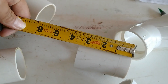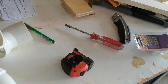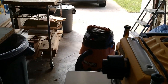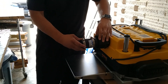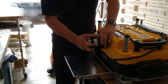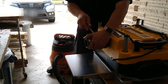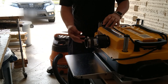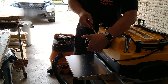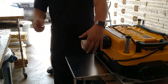The PVC pipe is cut into one piece at three and a quarter inches, and then two pieces at two and three-quarter inches. This first piece will go in first, and then that will connect to the turn ends. Let me turn this around. Take this two-inch adapter and make sure you shove it all the way in as far as you can while still being able to access the nut, because the further you shove it in, the more support you get from the hose. I've seen people talk about snapping this off when you put a rigid pipe in, so the flex coupler actually helps — if you have any kind of stress on it, it won't crack the connector.